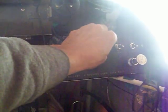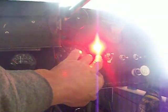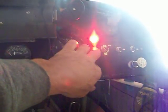What you'll find though is as the plane is flying after that, you have this irritating blinking light on, and there's no point shutting it off. If you put a switch on it, there's potential that you could forget the switch the next time and then the light doesn't work. So what I do here is I bleed a little fuel back into the header tank, just enough to shut this light off, and when it's off then I turn the bleed off and run off the main tanks, and that's it. It's a fairly simple system. That's just one way of doing it.